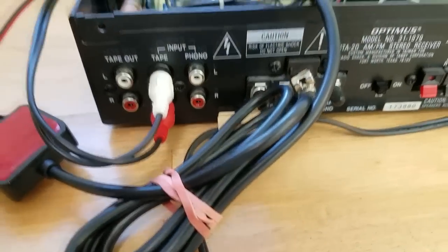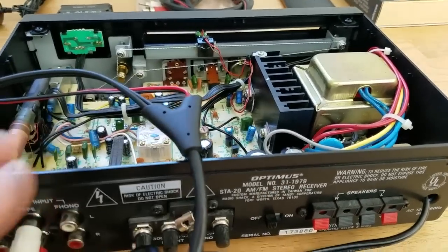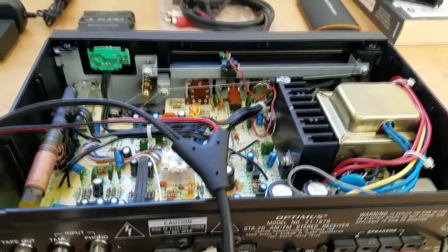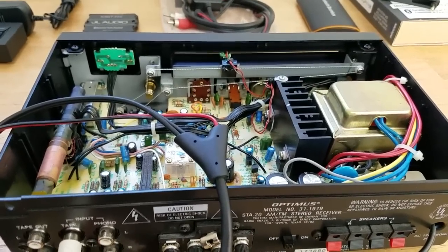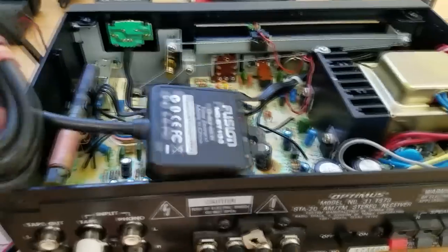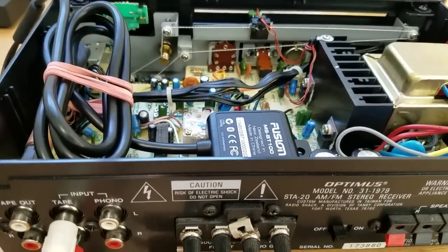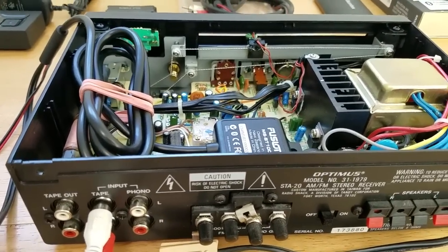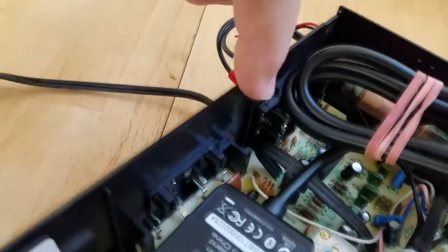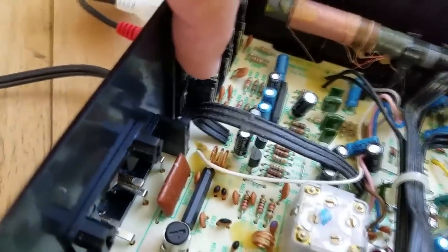I'm doing this for a couple of reasons: maximum range, and not interfering with anything inside. If you have an old vintage home stereo or large audio/video receiver, you'll have tons of room, and if range isn't a big deal, you can just pop this in there, double-stick it wherever you'd like, and you'll have a really neat, tidy setup — you'll never see the Bluetooth device. Hook the RCAs on the inside, either on the back panel or directly to the PC board.